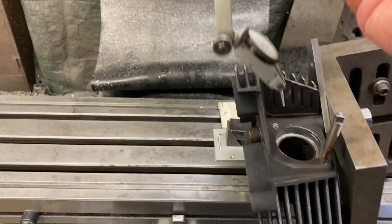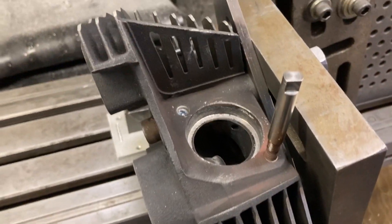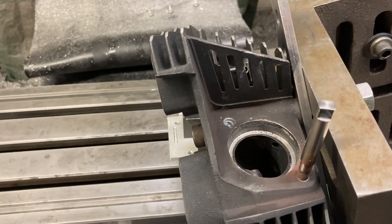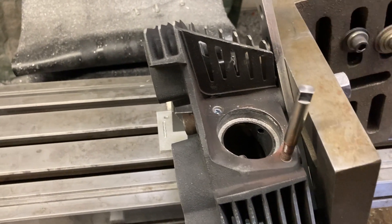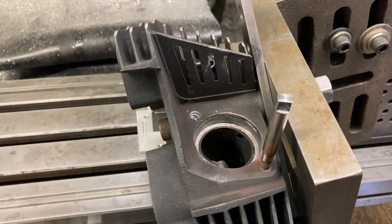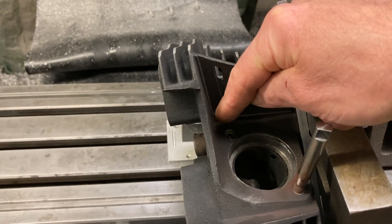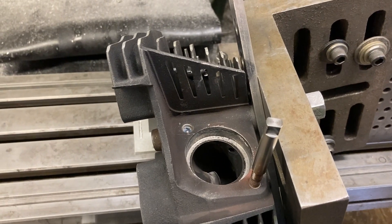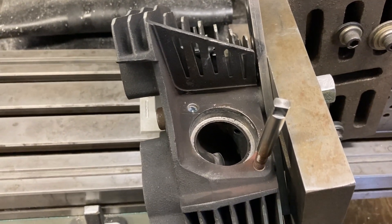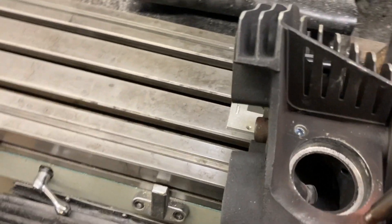I swept the ball with my indicator in the spindle, swept that ball, and called that zero-zero — so I had a zero-zero location for orientation. I don't really know where the broken hole is; I can eyeball it, but I figured if I put the indicator tool back on the good stud I can dial out to it and figure out my XY coordinates. Sure enough, it dialed out to about 0.813" in X and minus 1" in Y. So I plugged that into my program and programmed the opposite — plus 1" minus 0.813" — positioned over it with my center drill.